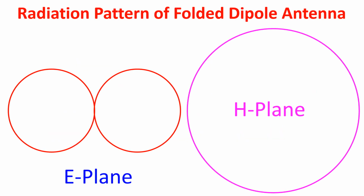One reason for using folded dipoles instead of usual dipoles in Yagi-Uda antenna is to increase the impedance. When parasitic elements are there close by, the impedance of a standard half-wave dipole antenna may be reduced, sometimes making matching difficult. Another reason for considering folded dipole as part of Yagi-Uda antenna is to increase the bandwidth in order to cover a full amateur radio band.